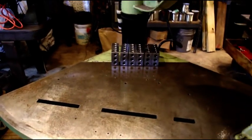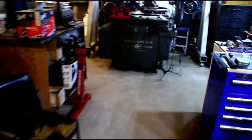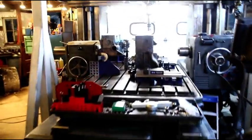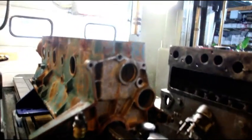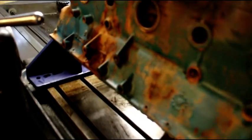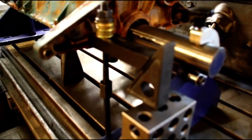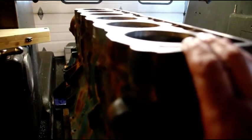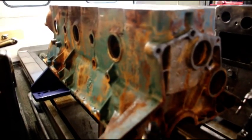The block master is cleaned up and ready for the next engine. On the SIP, I have Scott's 258 all jigged up and ready to be bored. Again, we are grabbing it by the crank centerline - I had to get creative on lashing it down, we've got some jacks under there. It is perfectly level and true so the bores will be perfectly in line with the crank.